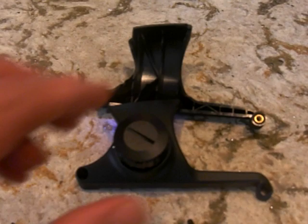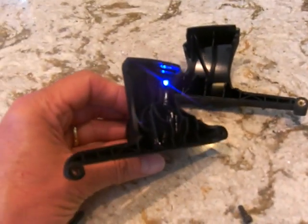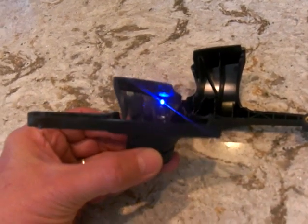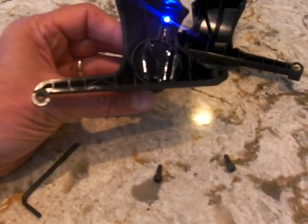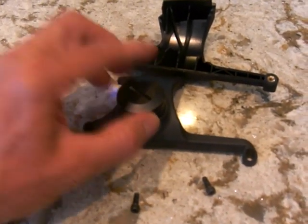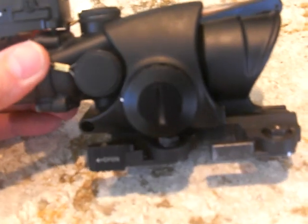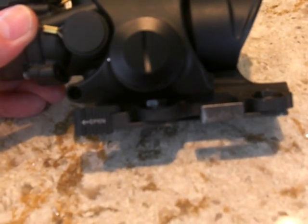It comes in two pieces and is made of a 30% glass filled polymer. It attaches on top with a little snap and has two hex screws. It fits the standard TA51 thumb screw mount and can also be adapted to attach for the quick detach mounts.